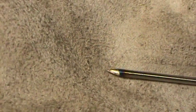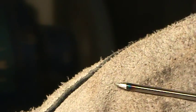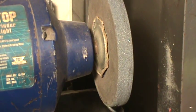You want to stick it in a drill and turn it. Unfortunately, this one wasn't that straight. Locate it and go up like that. It was a little bent so it didn't come out that great. That's all you need to do to sharpen the tungsten electrode. It's pretty sharp, and it's going to do what it needs to do when we do the TIG welding.